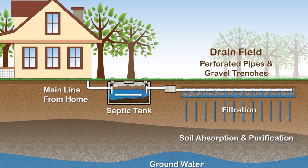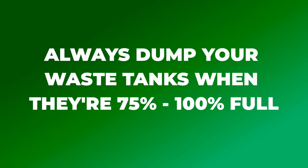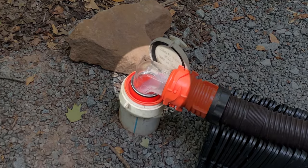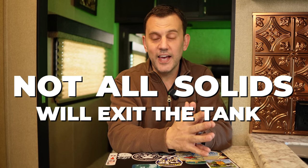A typical septic system breaks down and digests solid waste so it can be eventually leached into a leach or drain field. In regards to a holding tank, there are a couple reasons we want to break down solid waste. The first reason is that liquids will exit the tank quicker and easier than solids will. A universal rule of dumping a holding tank is to wait until it's full, and by that time there will be enough solid waste and toilet paper to potentially clump together and cause clogs.